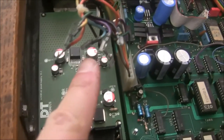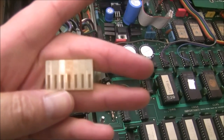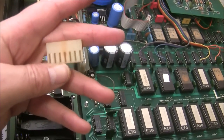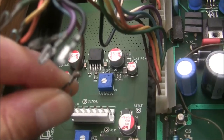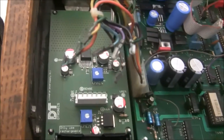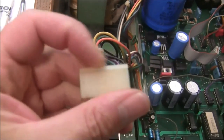Here are those connectors — they're totally corroded. The 5 volt rail connector is just totally black inside. The housing on the backside is actually scorched: when the short was ongoing and someone had changed the fuse to a larger one, it generated so much heat it burned the housing. There's also evidence of tack-soldered wires and battery corrosion. We're going to cut these off, strip a little clean wire, crimp new terminals on, and put them back in the same housing.